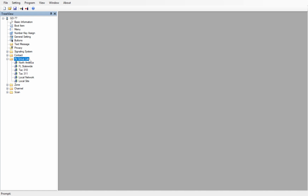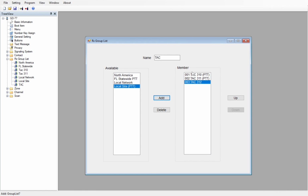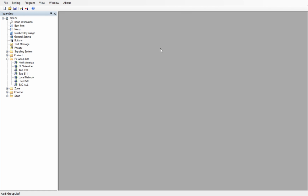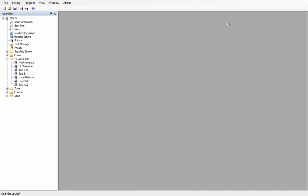You can make another one. Let's call it TAC, group list 7. We can add all the TACs in here. So now, if you have a channel and you pick TAC, you'll be able to hear all of them. Let's call this TAC all. So if you have this RX group list, you'll be able to hear all the conversations going on here. You'll just transmit on the talk group that you have that channel set to. Done. So add whatever you want. I have North America. I have statewide. I have TAC 310, 311, local, local site, and TAC all that we just made.